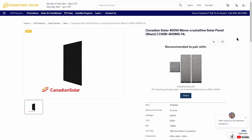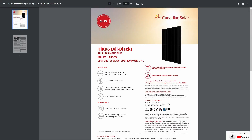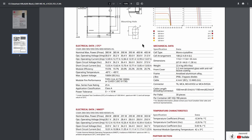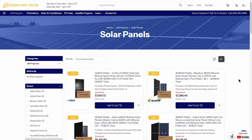I also wanted to give you guys an example of a solar panel that will not work well with the F3800. This is the Canadian Solar 400 watt panel — be aware there are a lot of 400 watt panels with similar specs. The VOC is much lower, only 36.8 volts, meaning the operating voltage will also be lower. Looking at the spec sheet, the optimal operating voltage or voltage max power is 30.8 volts. On the F3800, if you have under 32 volts, it will limit it to 10 amps. So if you put a bunch of these in parallel, you are going to be limited to 10 amps only, or around 308 watts. You need to check the specs before you go out and purchase solar panels for your power station.